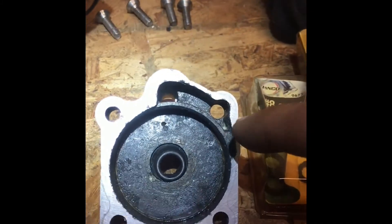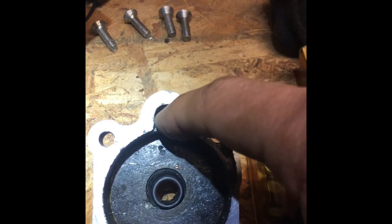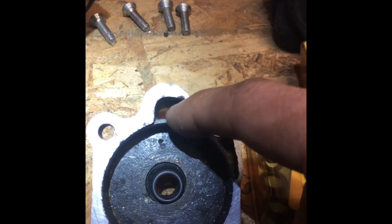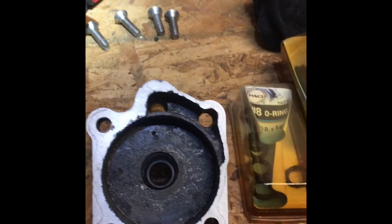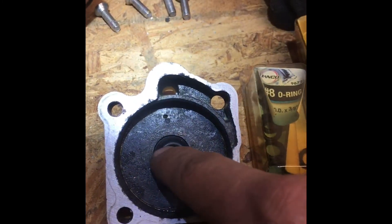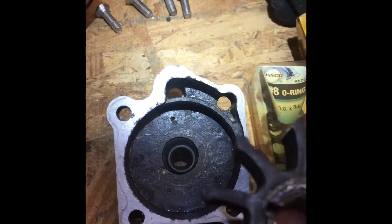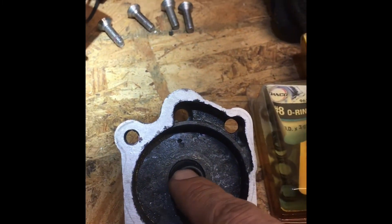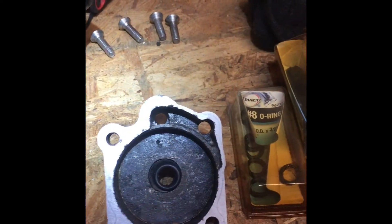Squeezing this through there prevents water from leaking straight up the shaft. After I cleaned out the pickup tube and made sure there wasn't a blockage, I realized water either wants to go through the shaft or up the pickup tube. If there's enough back pressure — even a little bit — it's going to go up the shaft rather than up the pickup tube, especially with old pump covers and old impellers. This completely fixed my problem. Maybe for you it's just a blocked pickup tube, but this stuffing box fix solved my issue.